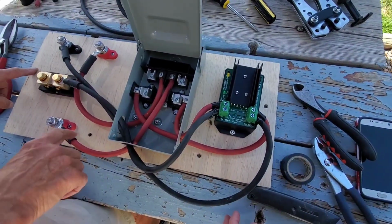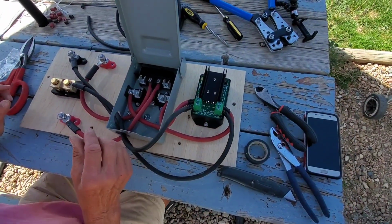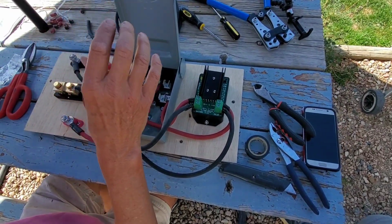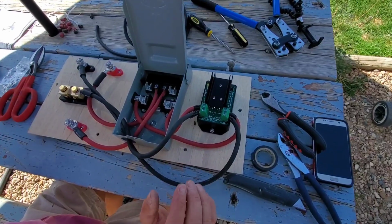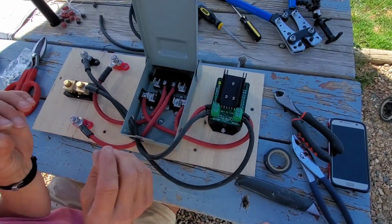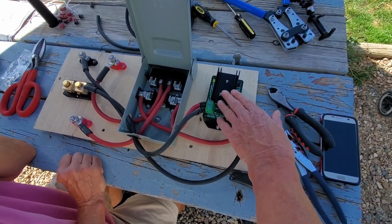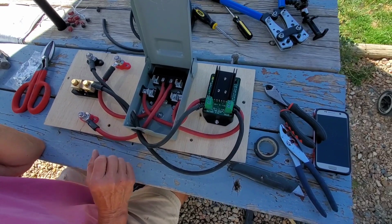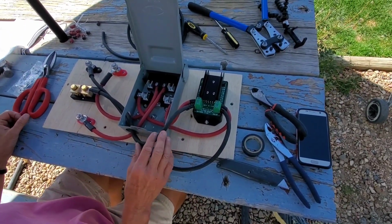Now, see, we drilled the holes in this board so that when we go to put it in the compartment, we just have to slide it on those holes. Yep, and bolt it into another wall. Bolt it into another piece so that you're not doing any of this work while you're crunched up in the crawl space. Yep. So we have our charge controller, which takes the solar and converts the power over to send to the battery. Right.